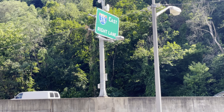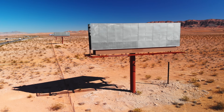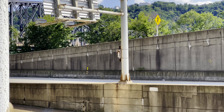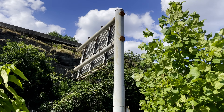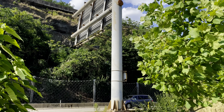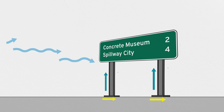A perfect example is a sign. Billboards and highway signs are essentially gigantic windsails. They don't actually weigh all that much, so the compressive force on their base isn't a lot. But the horizontal forces from the wind can be significantly higher than that. Those horizontal forces can increase the compression force on one side of the baseplate, but they can also result in shear and tension forces between the baseplate and foundation — so you've got to have something in place to resist those forces too.